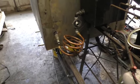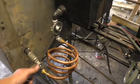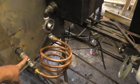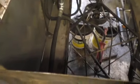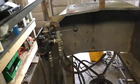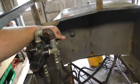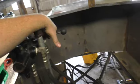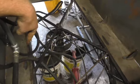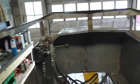Alright, so I have that all plumbed together. I need to get a swivel in here, because obviously I can't turn this and spin it on there. And then that line runs into there and up to my switch. This is going to work like this: to go left, you push forward, and to go right, you pull towards you, and that will operate the axle down there and operate that cylinder. So yeah, it's getting there. Pretty sweet.